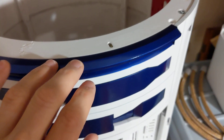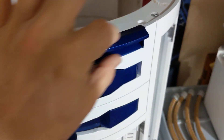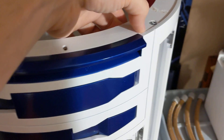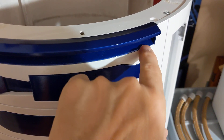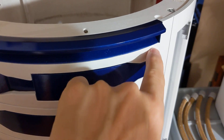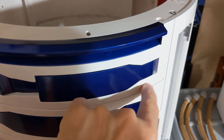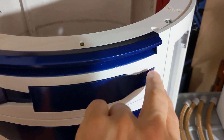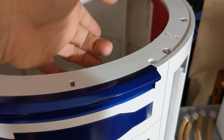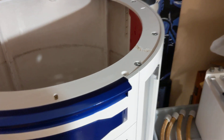It's not necessary but it's better to do it now. The bottom is two pieces sandwiched and bolted together. The upper utility arm has a pin that goes through underneath the large data port, through a bearing inside the utility arm and another bearing at the bottom, and then a little bit into the body to hold the utility arm in place. To get that pin in, the data port has to come out and the top ring has to come off — or maybe you could undo half the bolts and lift it up enough.